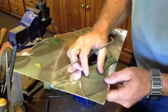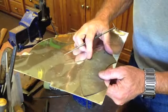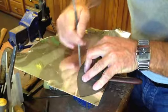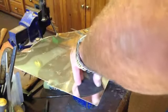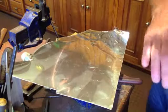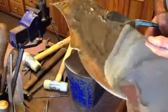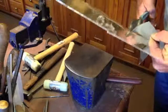The first stage before blocking is to mark out on the silver sheet the panels to make the milk can. Then I'll do the blocking process where we actually hammer them up to get the shape. So we just scribe out like this, and then the next thing will be to cut these out. This will be done just with a pair of snips — cut this out like here, just following the lines around.